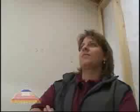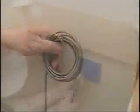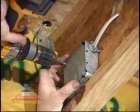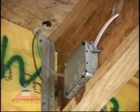First, locate the control on an interior wall away from direct sunlight and other heat sources. Make sure the power lead will reach the control. If not, think about where you can locate a junction box in a wall or under the floor so your power leads can connect to the Romex that goes back to your control location. Don't forget a cover plate.